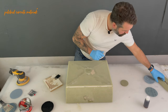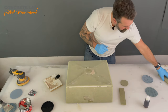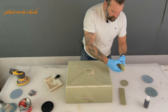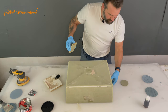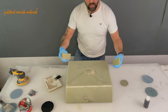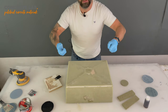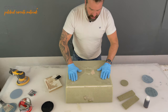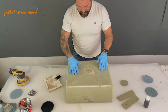We'll also need to attach these to the inside as well. Now, these two go together, and one attaches on the inside of the mould of the insert there and the other one there. And the reason for that is when you've cast your concrete, you're going to need something to grip onto to pull this insert out, especially if you want to reuse it. But obviously we'll get to that later on in the video series.